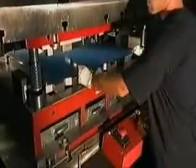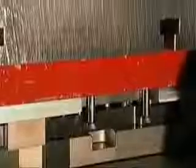Production begins with a computer-guided machine that cuts out a sheet of galvanized steel to make part of the hood's housing. A 300-ton press then perforates the sheet and cuts out up to 50 openings for screws, wiring, and exhaust outlets.